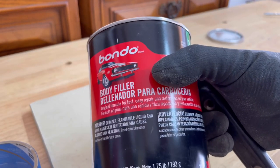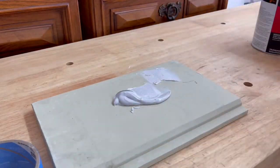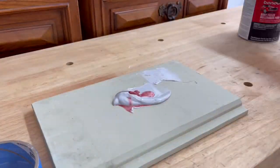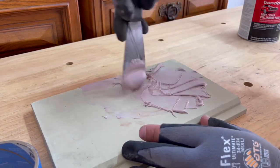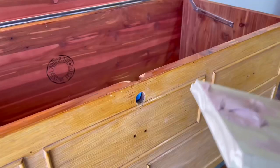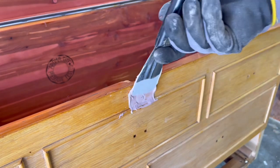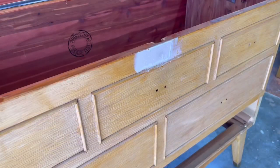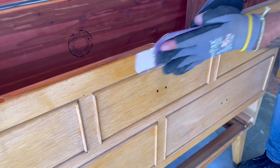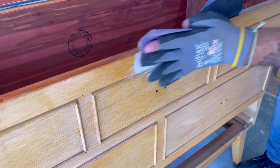To patch the missing lock hole, I'm using Bondo. You mix together the Bondo with an activator until the color is consistent. This stuff sets up pretty fast, so you want to try and get it on before it dries up on you. I think I applied a little bit too much activator because, as you can see, it started drying up on me right away and clumping up. It's typically ready to sand at about 30 minutes, so I like using it over wood putty because wood putty takes a lot longer than that.